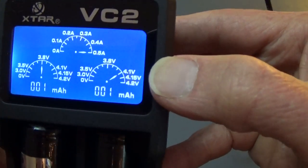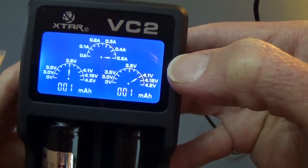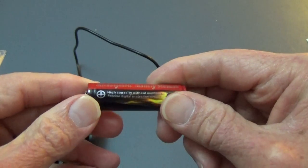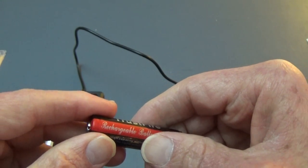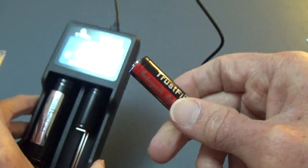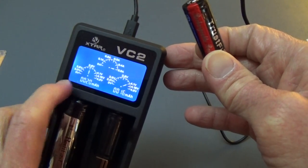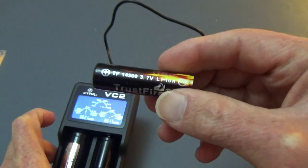Once it gets up to 4.2, you'll see these dials go up to a maximum of 4.2, showing the battery is completely charged. Earlier I put a 14500 into the charger. When I put it in, the protection circuit had already kicked in — I was using it in a flashlight, the protection circuit kicked in, and the light shut off. Ostensibly, this battery had no more power in it. I put it in the charger and it registered at exactly 3 volts. I ran it until it stopped.